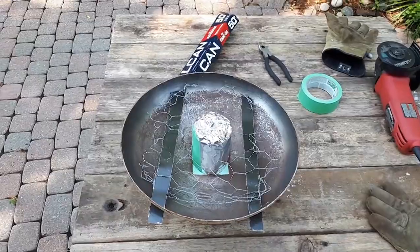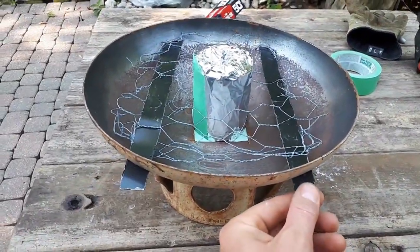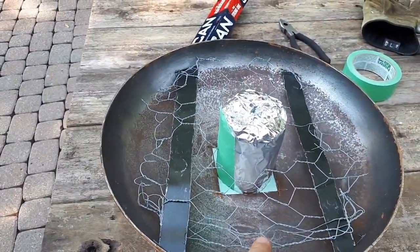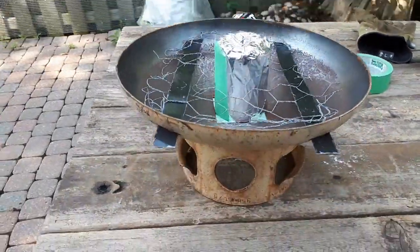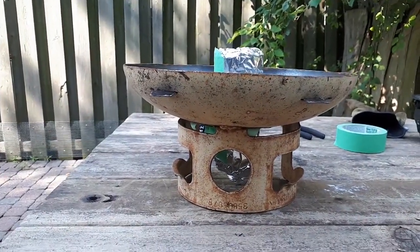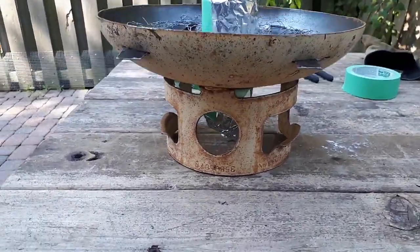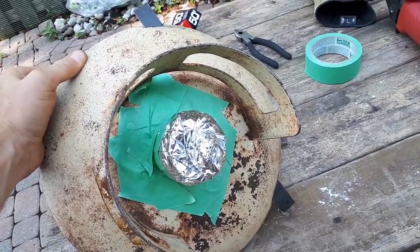Okay, I've got my lid all ready to go. I threaded my little strips of baking sheet through the slots I made. I wove them through the chicken wire, cut a hole in the chicken wire, and put in my tin foil wrapped beer can. Here's a hot tip: use a tall beer can to make sure that it sticks up above the level that you're going to pour the refractory cement. Using a tall beer can also means you get to drink more beer, and there's nothing wrong with that. And on the back side here, I just use some painter's tape to cover up the holes